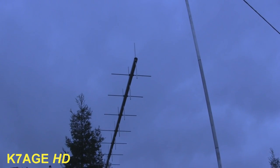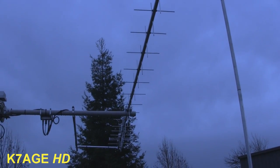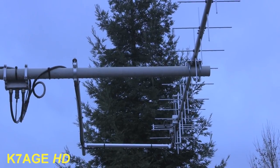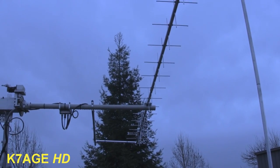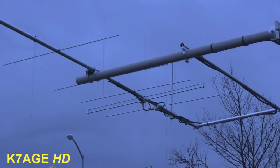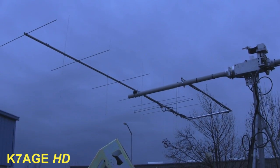The antennas have both vertical and horizontal elements which are fed out of phase to set up a circular wave for the polarization. They run the coax across the back to feed it out the end and back up, so the coax doesn't upset the pattern — a little more substantial than just hanging the coax down, which is what you see in a lot of pictures. And here's the 2-meter, same type of coax routing off to the side with an arm to bring it back in. Very nice.